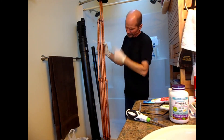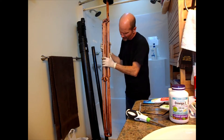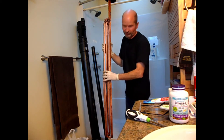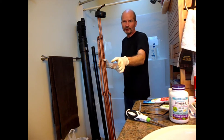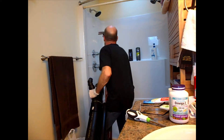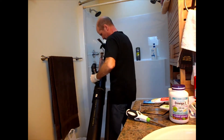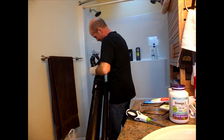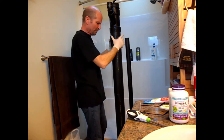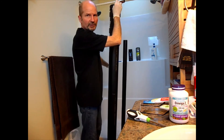It's 25 to 35 feet of piping up and down. I did about 10 feet up here and 12 feet down here, kind of broken into two halves. It goes through the bottom section first, then through the top section last, then comes out and goes through the hot water tank. Ice cold water comes in — and this is from this shower only, no other dirty water, strictly shower water.